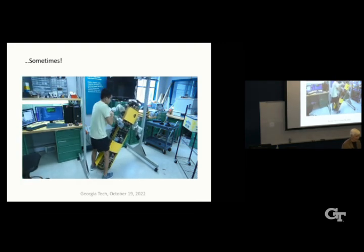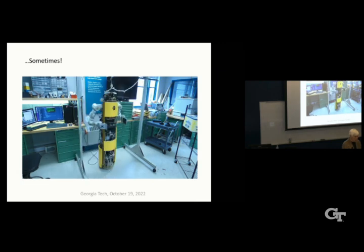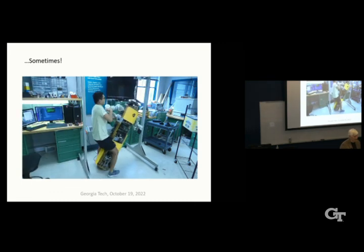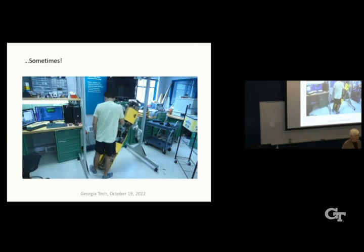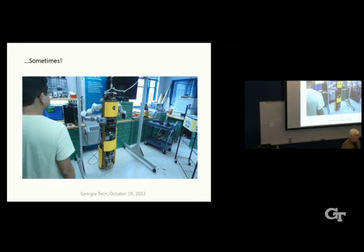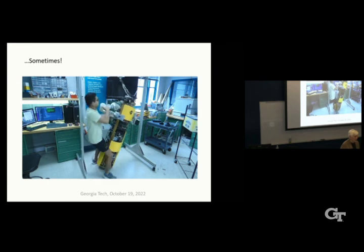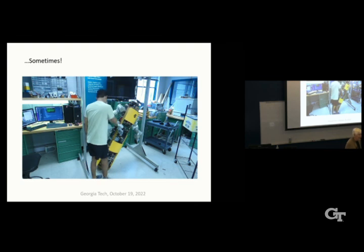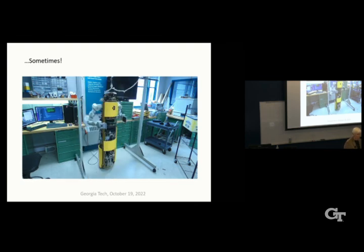It doesn't slip with the floor. It doesn't slip with the rollers. But it requires the rollers to be pretty forcefully interpenetrating the ball to do that. I had a whole master's student do nothing but study how the inverse mouse ball works. But if you hit a pool of water, it's just like when you slip on water in the restroom. The sole of your foot is made out of the same stuff, polyurethane, and you're going to slip. So water is not good for Ballbot.